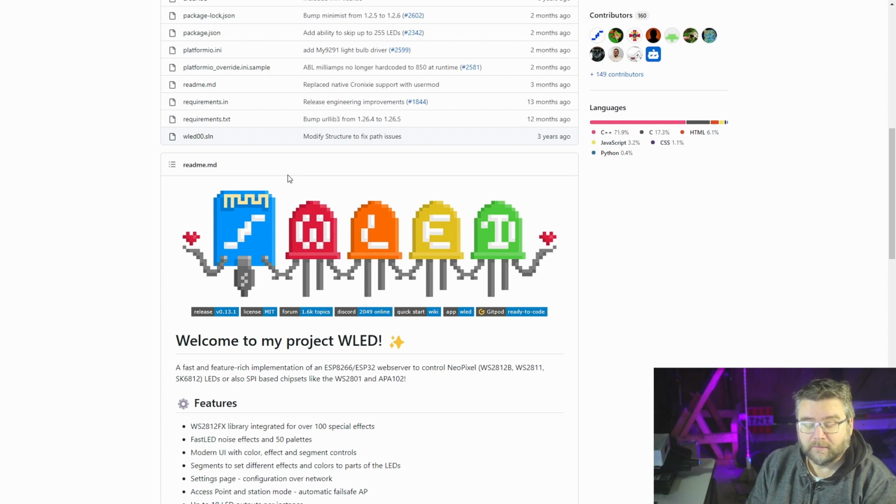I almost exclusively use these little controllers, mainly because they do everything I need them to do. It's kind of a dumb terminal for LED strips. You can use ESP32s like I mentioned, but that controller has dozens of pins for all sorts of inputs and outputs, but LED strips need one pin, and these little ESP-01s have two pins, so you could have one as an input and one for output, so there's not much redundancy there. Whereas you're spending money on these other things, and they're bigger, and they could be used for other things. And these are super, super cheap in comparison.